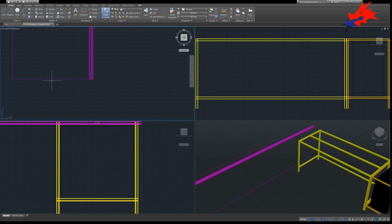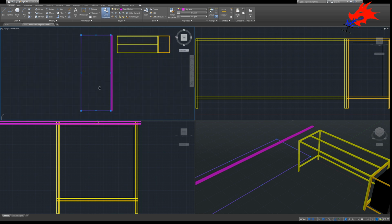These models, thickness of sheet metal. With the perforated steel, the 16 gauge sheet is 0.060. So I was backwards on the square tube versus the perforated sheet metal. Sheet metal is 0.060. Square tube is 0.065. So I was mistaken on that, and I apologize to everybody who was relying on that information. But it's all right though. When you told them what you wanted, they'd be like, "What? We don't sell that."